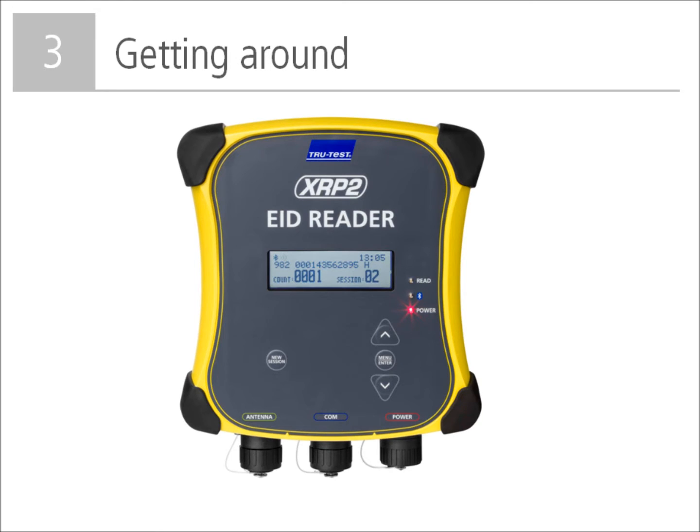Before using the panel reader, it is useful to know how to get around. At the bottom is the antenna connector. To use the reader, you must connect an antenna. The connector labelled COM is used to connect to a weigh scale indicator using the supplied serial cable, or to your PC if you also use the USB serial adapter. The bottom right connector is for power. You can use the battery leads or the mains adapter as covered in the last section.